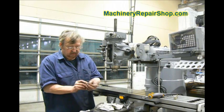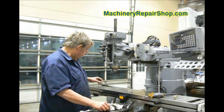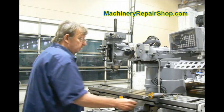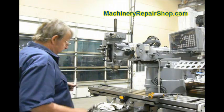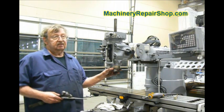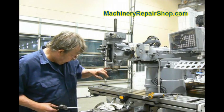Don't lose it. Notice it's a pointed set screw because it's locking the threads in. Once you do that, this collar unscrews. While it would be nice to have the proper spanner to do it, it doesn't matter. This collar should only be a snug fit — it shouldn't be super tight. Actually, when you put it in there, you hope to have a little gap when it seats.